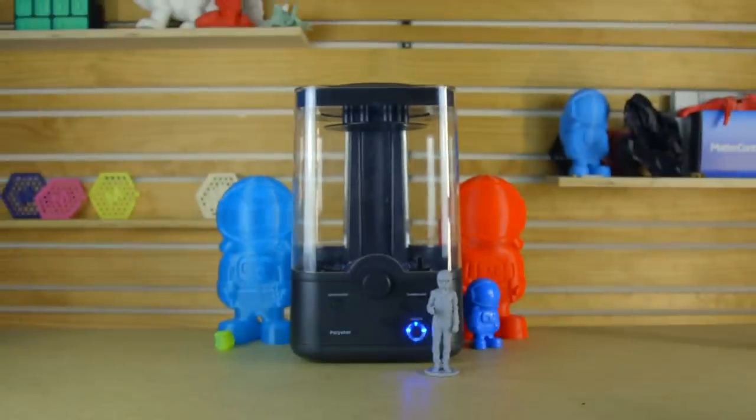To start off, you're going to need a couple materials and tools. You're going to need a polisher, a well-calibrated 3D printer, PolyMaker Polysmooth material, isopropyl alcohol, and paper towels to clean up any mess. Now, the reason I mentioned you need a well-calibrated 3D printer is that while the polisher does smooth out your 3D prints, it's not going to remedy artifacts and major defects in the print. So if you have skipped layers or some under-extrusion or infill showing through, it's not going to recover you from that, but you're at least going to smooth out some of the major stuff.